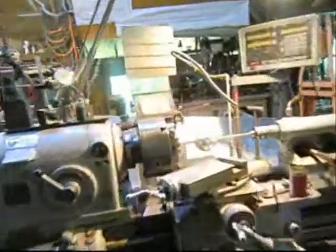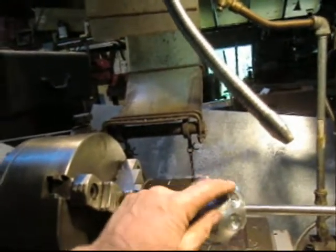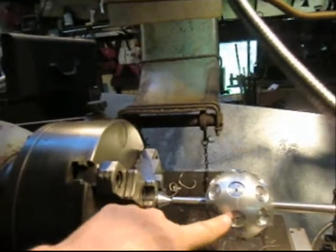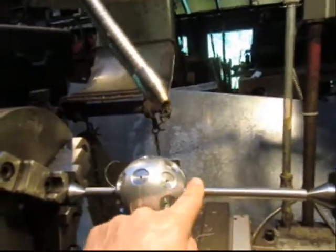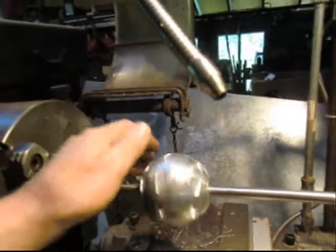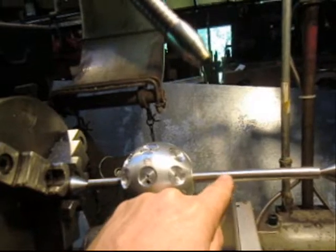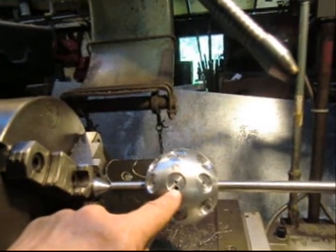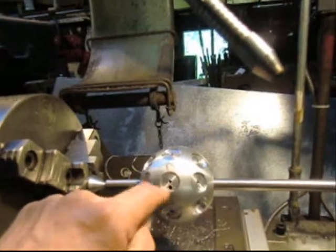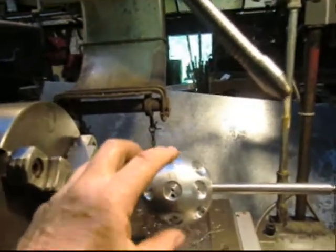While she's doing that, I'm over here at the lathe. I've gotten the ball finished, although it's gotten messed up a little bit — some scratches and dings. I think I can come back and do one final pass to really lock the ball in and center it concentric with the shaft. What I'll do is come in and cut a small flat in the shaft so that the lock nut or lock keeper can screw down into the shaft and lock this whole thing in place. Then I'll come back and do my final pass and square everything up with the shaft.